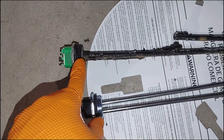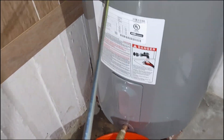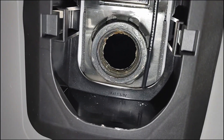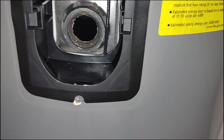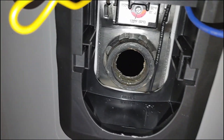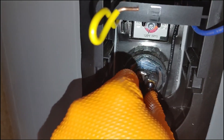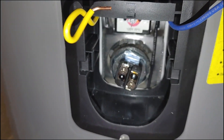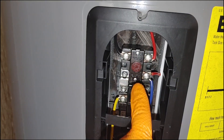Generally it's a really easy job to pull out, but if it broke you might have some trouble. Before putting the new one back in, clean up all that crud around the threads — use a firm bristle brush, like a toothbrush — and clean those threads up. If you don't, it could result in leaks. Once the threads are clean, there's nothing to put on them — no plumber's tape or anything. Just screw the new one in firmly, making sure it's straight so you don't cross-thread it.